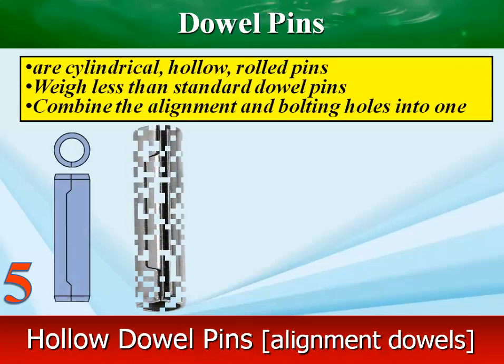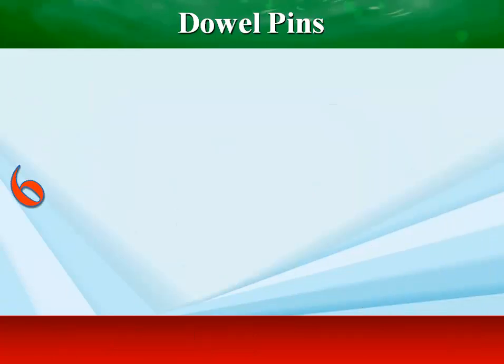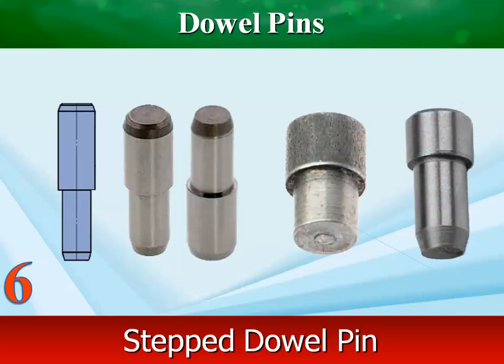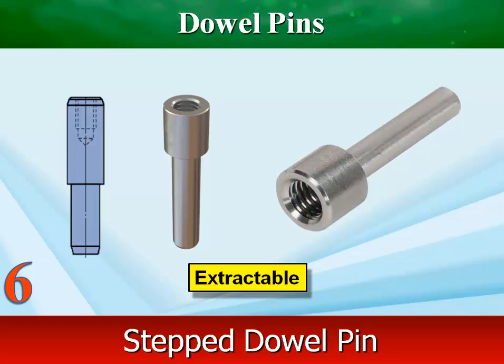Hollow dowel pins are cylindrical, hollow, rolled pins. Weigh less than standard dowel pins. Combine the alignment and bolting holes into one. Step dowel pin has two or more different body diameters. Extractable step dowel pin has a tapped hole for pulling the dowel from its location point.